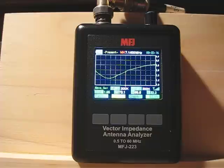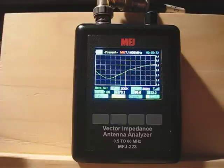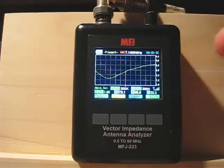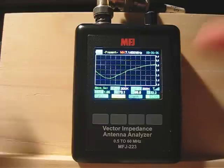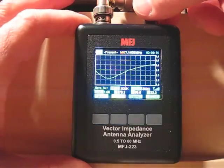In a couple of seconds there's your reading. It's telling me the SWR at that frequency is 1.850, resistance 65.6 ohms, reactance 32.2 ohms. The downside is it doesn't tell you plus or minus for the reactance. You can't determine which side of the dip you're on just from this reading — your transmission line acts like a transformer and the reactance value changes along it. You would need a Smith chart to work backwards to find what it is at the feed point. So we don't know at the end of this transmission line whether that's +J32 or -J32. This really isn't that kind of analyzer — you'd want a different type that does indicate plus and minus.